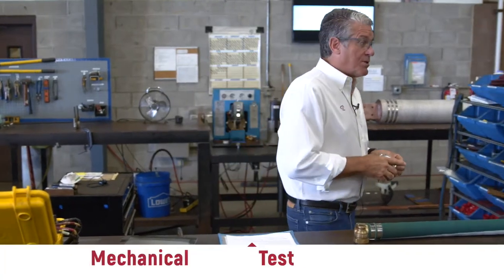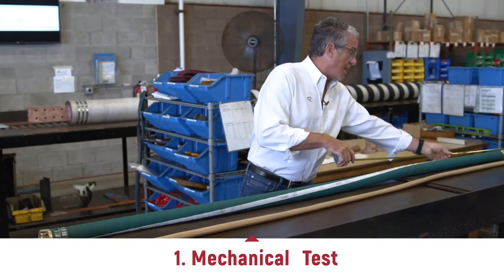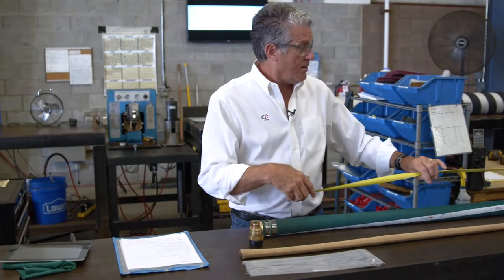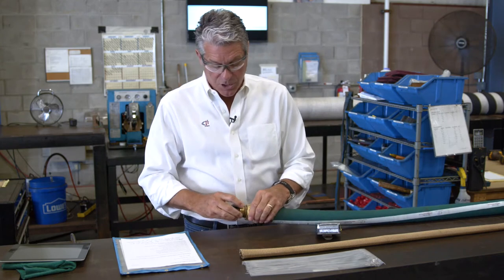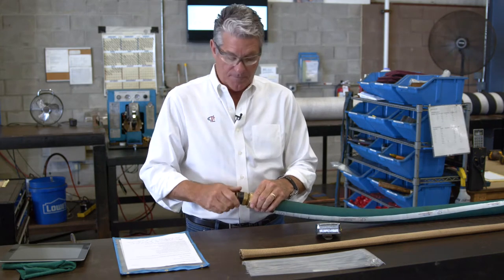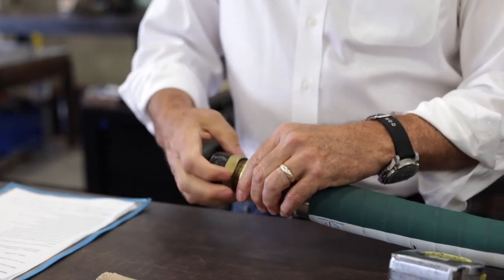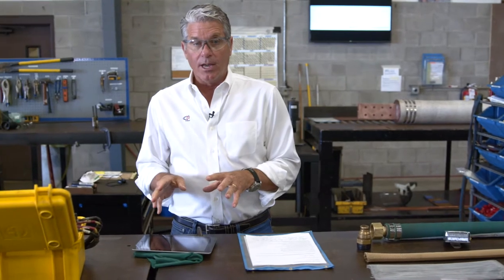So there are a number of things we do. First, we'll do the mechanical test to make sure that dimensionally everything is accurate. We have an overall length check of 103 inches — spot on. We will do a thread check to make sure that it's going to have proper interconnection with the furnace coil. Threads are good. Then we will record this digitally. It'll stay with the job traveler and be forwarded to the job file.